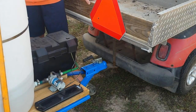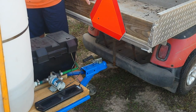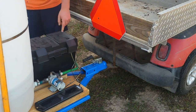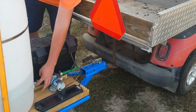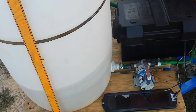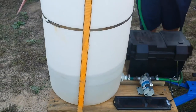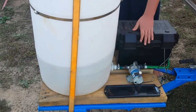We had the battery box already, and the pump from last time, and a battery in here already. So I wired in the solar panel to keep the battery charged. On this side, I have a switch. I use this bulkhead fitting down here — it's kind of specialized, but at Home Depot they sell them. It's called a bulkhead fitting, then a barb, a short piece of hose, and then I have my hose right here for spraying with.